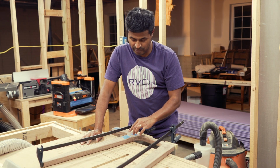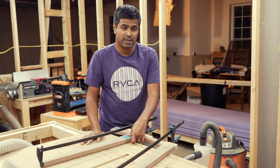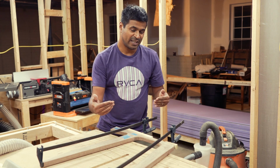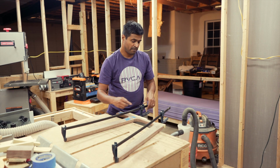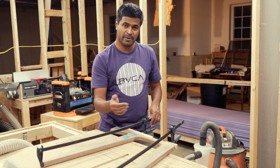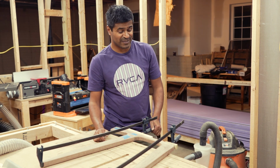During sanding, I had removed the original blue tape markers and put replacements, but it turns out that I hadn't put them in the right place. So I initially ended up aligning the pieces, the leg and the armrest, incorrectly. Then I realized I was able to pull it out, realign the domino, and glue it back together. But it was very stressful.